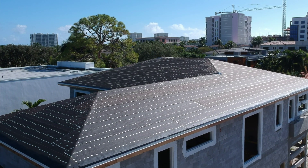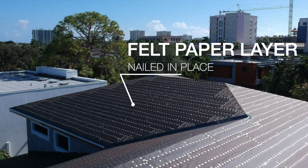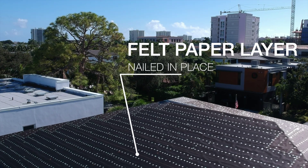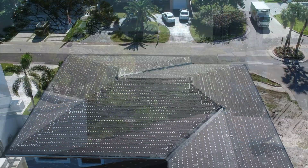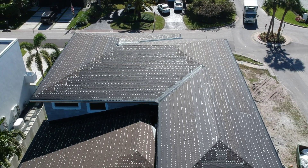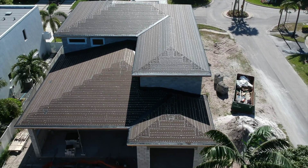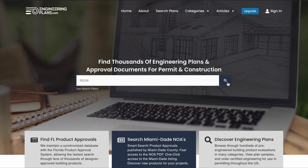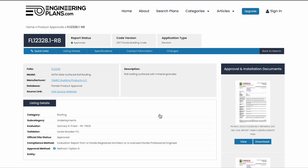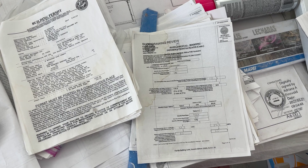After the plywood comes a 30 pound felt paper base sheet. The base sheet comes in three-foot wide strips, each sheet overlapping the other, and are nailed per the engineer's requirements, which originate from the Florida and international building codes and the felt base sheet's Florida product approval. Florida requires that products comprising the building envelope be tested and approved for use at each project. This Florida product approval is FL12328 and can be viewed on engineeringplans.com. Florida product approvals contain performance and installation information for over 30,000 building products relied upon for construction across the US.